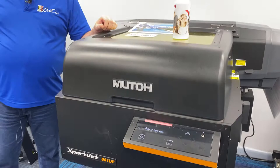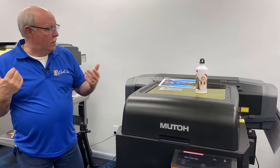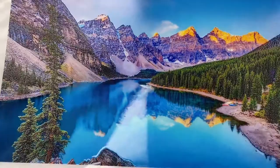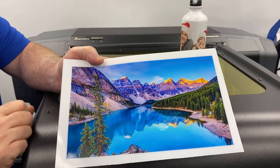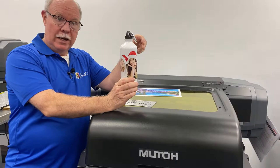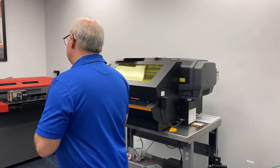Roughly the same print areas. The Compress 600 has 11.8 inches of depth, and the MUTO 661 has 5.9 inches of depth. Why would you get the 661 as opposed to the Compress? Number one, the MUTO machines are certified to do ADA Braille, which is printed on the 661, and you're not going to do that on the Compress. They also do an amazing job on varnish — you can see that this water literally looks like water because we have a gloss varnish from the MUTOs. On both the 461 and the 661, we can do this, which you're not able to do with any other machine on the market. The 661 is also great for cylindrical items — there's a device you can add that allows you to do cylindrical items, which is not available on the 461. So if you're looking at the MUTO line and need to do cylindrical items, you'd want the 661.